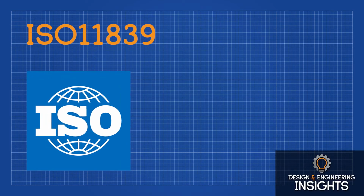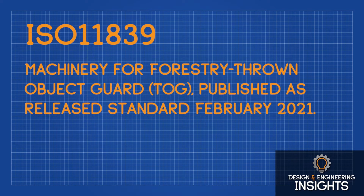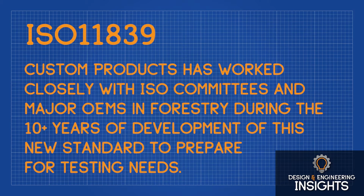Thanks for having us. Maybe just to start the conversation, if you could provide an overview of the new ISO 11839 machinery for forestry thrown object guard standard recently introduced. The new standard is a revision to ISO 11839. It's a thrown object standard for mulchers, disc type attachments. Previously, it specified glazing and panel material for thrown object of saw teeth. The standard has been updated to establish a laboratory test method for performance requirements of thrown object guarding to protect the operator from reasonable thrown objects.